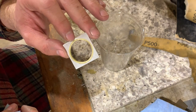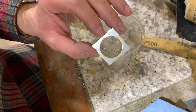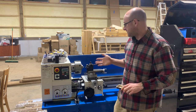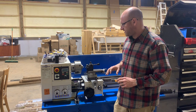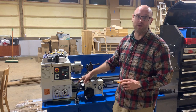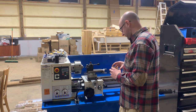And drill a hole, make a new inner ring, and make a stainless steel pin. The lathe is looking a lot cleaner than the last time I showed it to you. I was doing some turning off camera, and it was sounding a little funky, so I thought, you know what, I'm gonna give this guy a clean up, clean the ways. I did replace all the gear fluid in the change gearbox, re-oiled everything, re-greased the external gears at the back, and it's sounding great again, and it's nice to have a clean lathe.